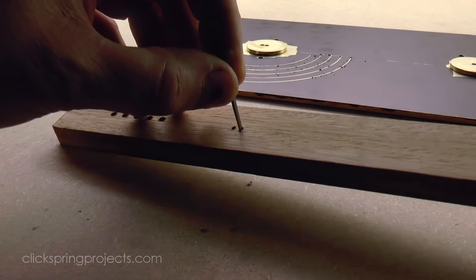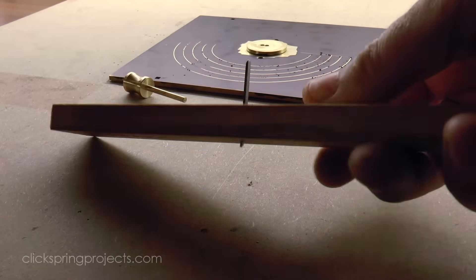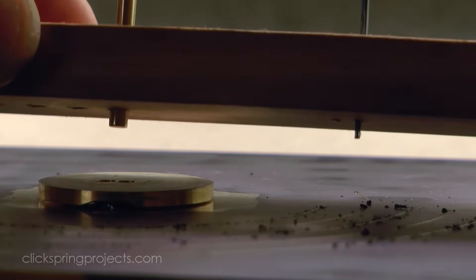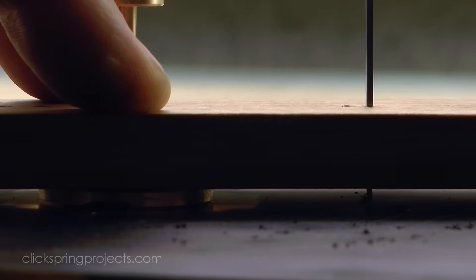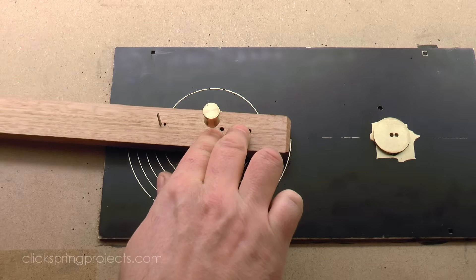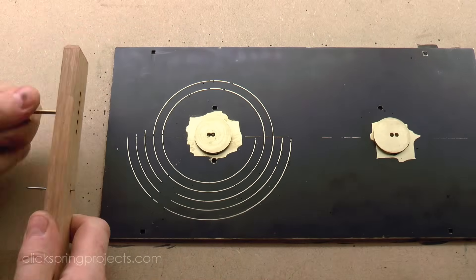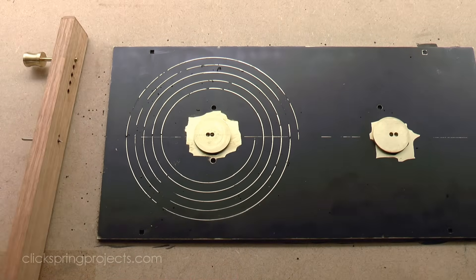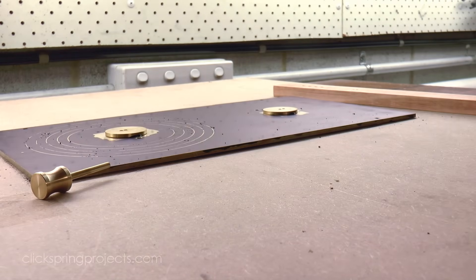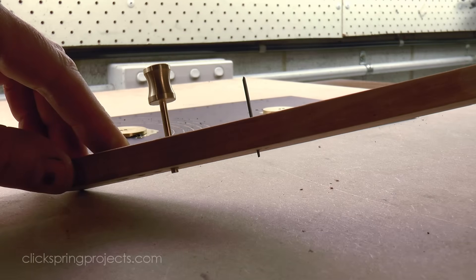As previously noted, the arcs are centered on different points of the rear dial plate, and to ensure that they meet up to form the complete spiral, the scorper location must also change to the adjacent position on the trammel. As the layout of the spirals begins to take shape, the maker's choice to simplify the curves from a true spiral to half circles starts to take on a particular significance, and serves as one of the best visual examples of the principles underpinning the mechanism's design — of very complex ideas framed and presented using the simplest geometric elements that in turn correspond to the basic drafting tools: the straight edge and divider.